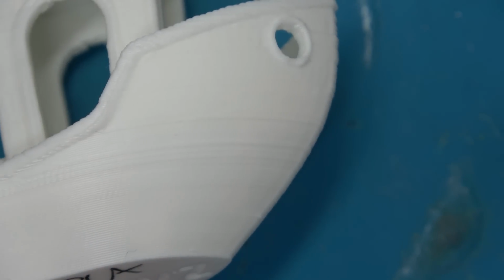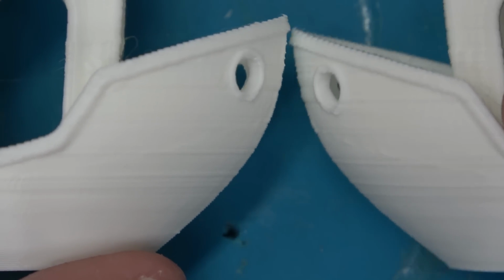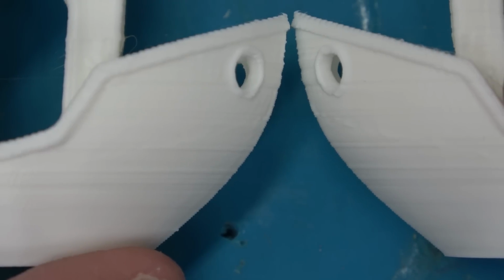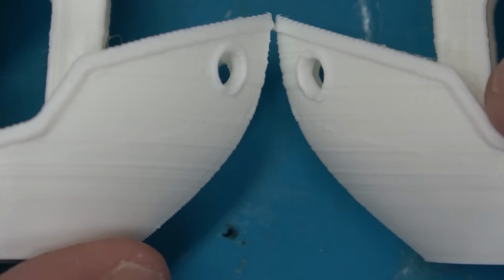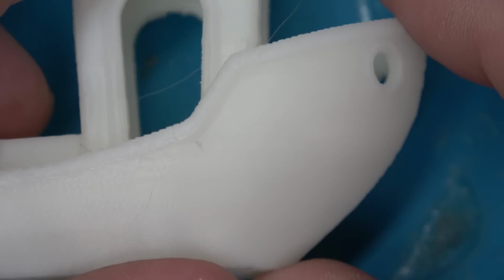There's also a new version of the software, which I downloaded. Here's a pair of Benchies I printed in regular PLA, 300 millimeters a second with the new firmware. There's line issues in the same place on both models. That's weird. It seems like on this printer, you might need the Hyper PLA to print at those speeds.